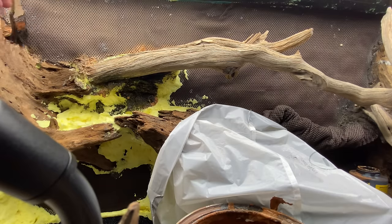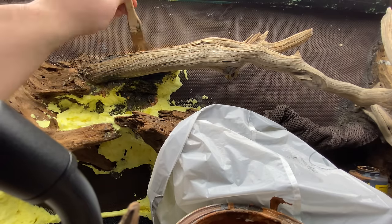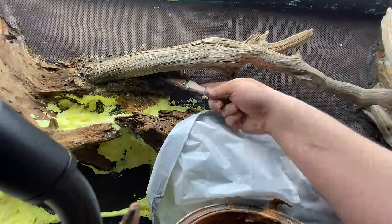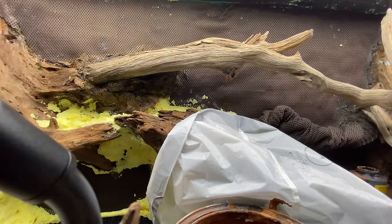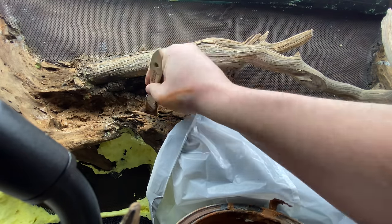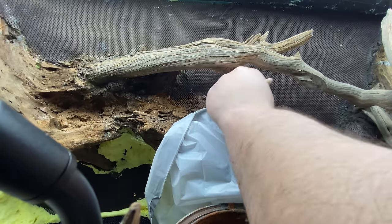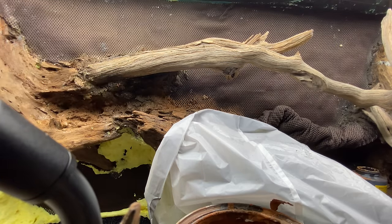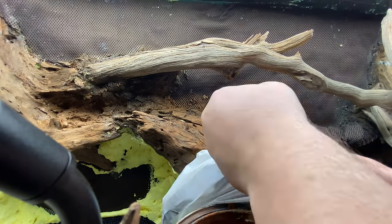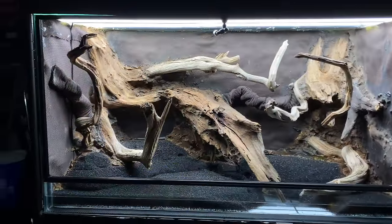Just putting the buff with the gray Drylok on, and then I'll put splashes of charcoal on it and blend it and just go back and forth until you get the desired color that you like. It doesn't have to be very detailed if you don't want it to, but it will look better when you don't have such a universal color and have back and forth, different shades, different tones. You'll have a better overall aesthetic.